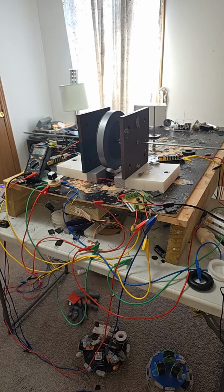Look at that. That is going so fast right now. This is 1 kilohertz on the trigger strand. So every time the magnet passes the coil, we unleash a kilohertz. So that happens 3 times a rotation. And wow, man, it's generating so much. All right. Cut that off. Saw that go down about 5 volts.